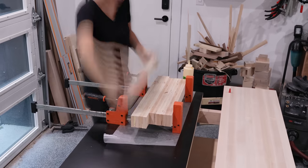The last feature on this bench is the gap stop. I was planning on just using one walnut board, but it was severely bowed, so change of plans — I'll make a sandwich. I re-sawed the board into two smaller pieces that I could get nice and flat — the bread of the sandwich. Then I re-sawed a piece of maple that will be glued in between — the cheese. I cut the cheese into smaller pieces that will create gaps in the gap stop that will act as tool holders. I laid out my most used tools to get measurements that would work for me and glued it all up.